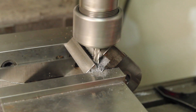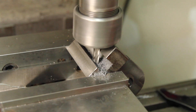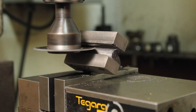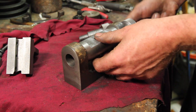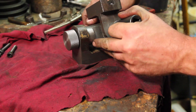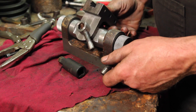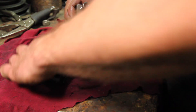Two more things to do on here real quick. One is to put a V-groove in the bottom in case I ever want to grind something round. Even with a really sharp end mill you're never going to have a perfectly square corner, so I need to relieve the corners — I'm just using a slitting saw for this. I'll replace these with some actual set screws at some point, but these are just what I had on hand.